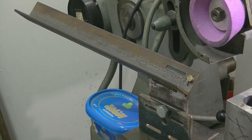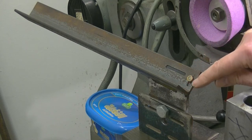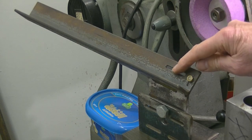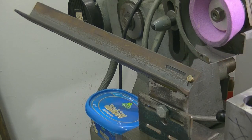Here's a different view of my dead simple large drill grinding jig — just a bit of angle for a bracket to the table, a bit of angle and a bit of flat with a bolt for a pivot. You can see the brass button in the front slot. I use that brass button to locate the flutes of drills up to about 25 millimeters. For bigger drills I move the brass button — it can be located up and down in the slot — and that gives me the ability to move along the slot and locate the flute of the big drill square on.